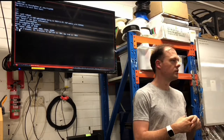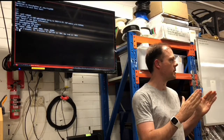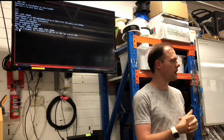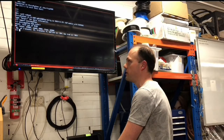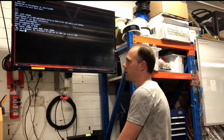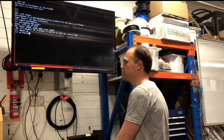Most of that 4K used is actually 4K for the FatFS buffer. So if you don't need to use FatFS, you can actually get 4K of RAM back. What we can do is reformat the file system using LittleFS. This is how you do it — this will become part of the documentation very soon.